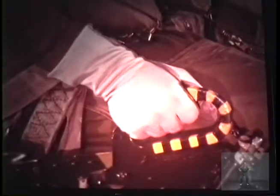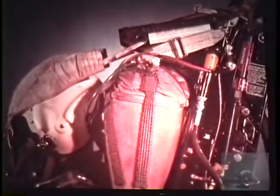If the time release mechanism should fail to operate, the occupant can manually free himself from the seat by pulling the emergency harness release handle. Through mechanical linkage, pulling this handle releases the occupant from attaching points on the seat, leg restraint cords, lap belt, shoulder harness, and personnel parachute restraint straps. It also frees his personnel parachute from the drogues and the ejection seat by means of the guillotine assembly.